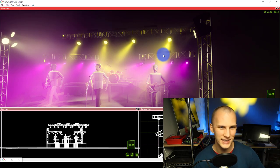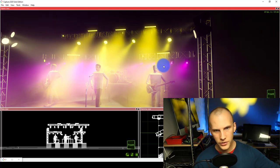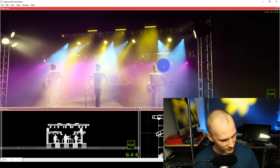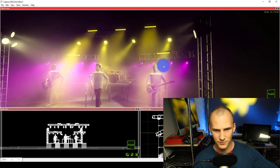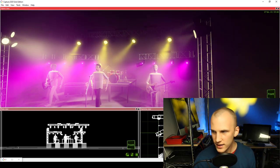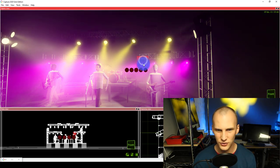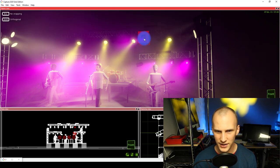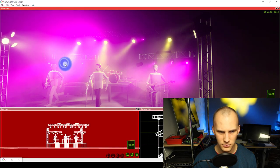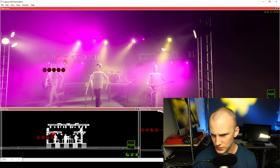One last trick for today's video, I know I've thrown a bunch of information at you in this video, is one thing you can do, I didn't do it in this rig, that can be interesting, is if you have a bunch of a given fixture, let's actually just look at it with these little ADJ Z4s, which are right here. If you have a bunch of a given fixture, you can actually go ahead between a couple different trusses and triangulate them, and it can look really good. So what I mean by that is just literally going ahead and grabbing all of the like fixtures.